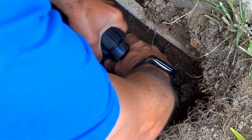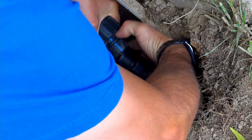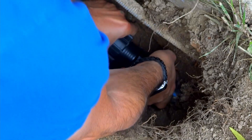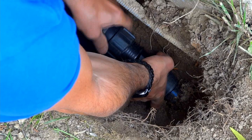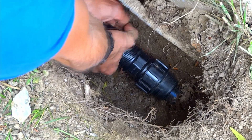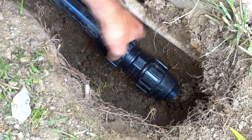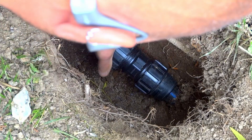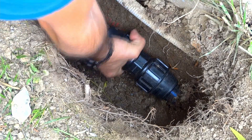To insert the second pipe in the joiner, you will actually have to bend both of them a little bit, so make sure you have enough room for that. Just push it in, and once it's inserted, it's a matter of screwing again. What I really like about this system is that you don't really need any additional tool, sealer, silicone or anything else. The pipe joiner itself will be enough to create a perfect seal between the two parts of the pipe.